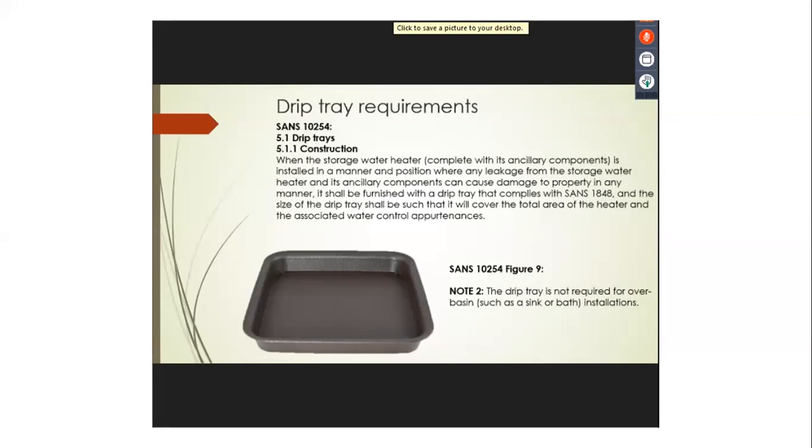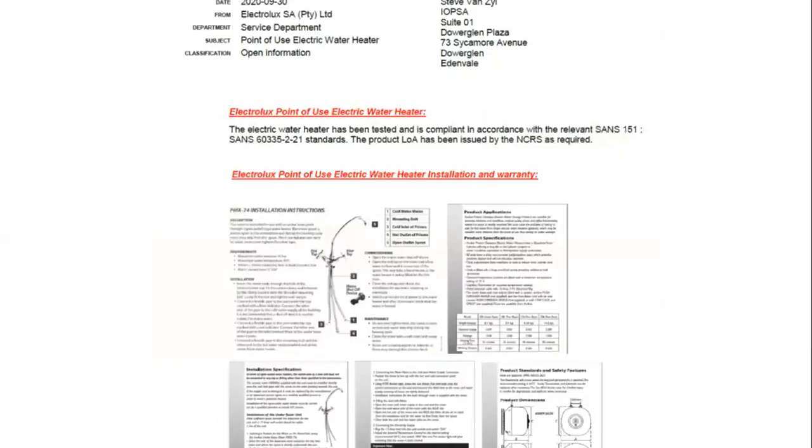And so you need to be clear and sure where you're going to install this basin. You may not install it directly underneath the sink. It may be a little bit away, specifically if you can, because you have to find a way for the drip tray outlet to discharge separately out of the building. Remember, if you're using a galvanized tray, again, the regulation states that you'll have 2 layers of a bituminous substance painted over it to give it that waterproofing. Very important. And remember, the drip tray outlet pipe must always have the correct fall on it, because if it doesn't, this water can overflow and then cause all sorts of trouble.